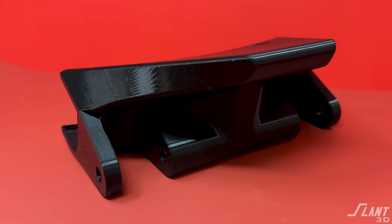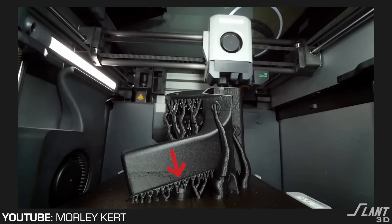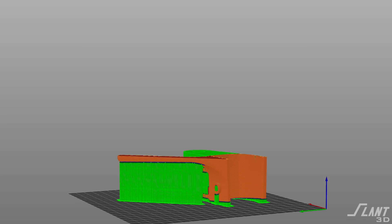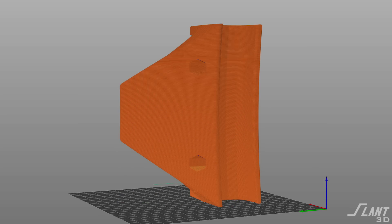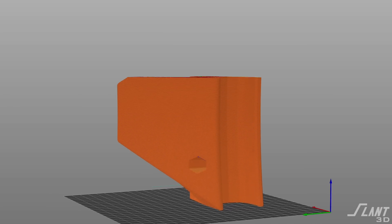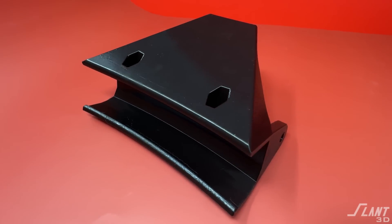In order to do that, the first place you need to focus on is the flap. Morley ended up using basically just a single peg leg, which is fair and decent, but then he ends up having to have support on it. Removal of that support can really increase the cost of a part because somebody has to look at it and peck at it, plus you're also wasting that material. By using a chamfer on the underside, you add more meat to the flap so that it blends into the Onewheel better. It is stronger, and you eliminate the need for support — it can print vertically and you don't have any need for support anywhere.